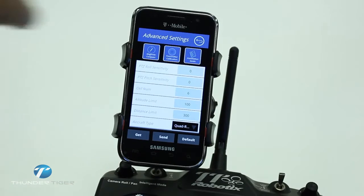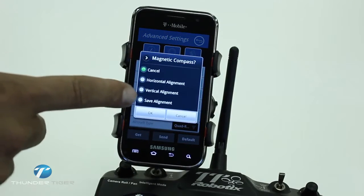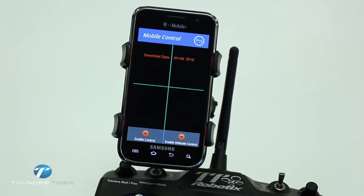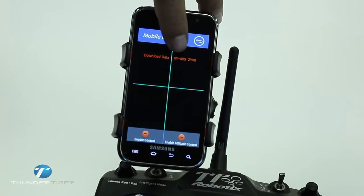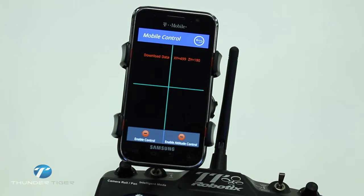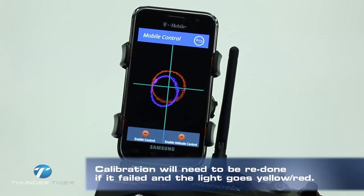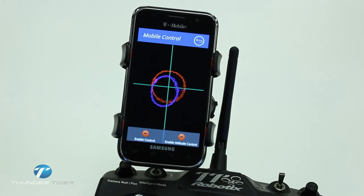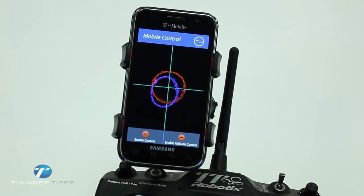We go back to magnetic compass calibration and we have the save alignment option. As soon as we hit save alignment and press OK, we'll see it uploading numbers — the XY calibration, and then the ZY calibration. What you see is a graphic of circles: one represents the vertical alignment and the other the horizontal alignment. The better we can get those circles aligned with each other, the better the calibration is.